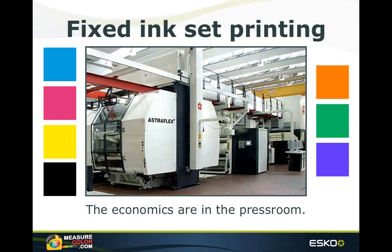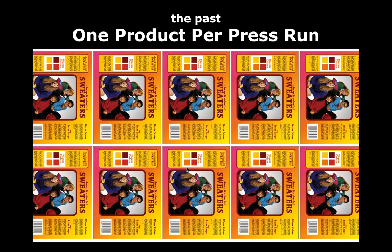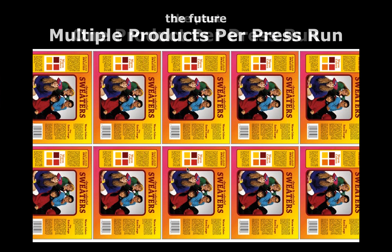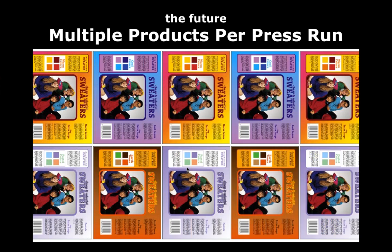But if you're going to print those 7 standard colors, you have to have a way to control it, and that's what Dan was talking about in the previous slide, and we'll touch on again toward the end of this talk. But equal to the savings of not having to change decks for each job is the ability to gang runs. One of the biggest limiting factors to ganging runs in the old CMYK spot color world is that a user or a brand could only gang items that had common colors.